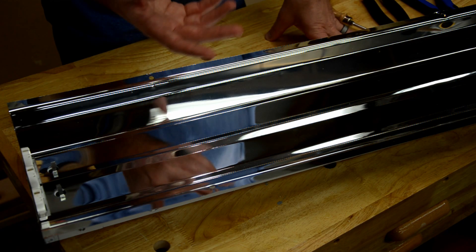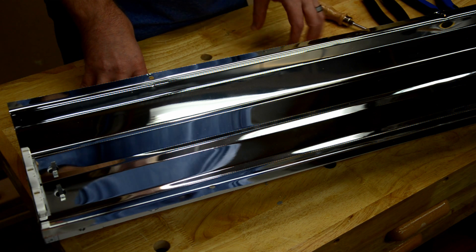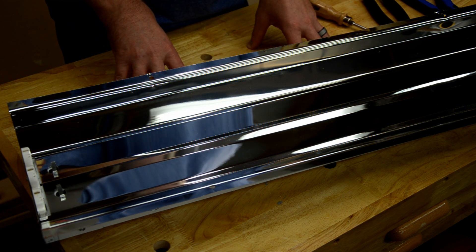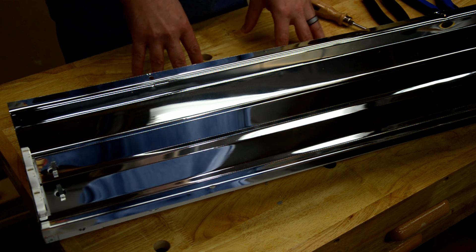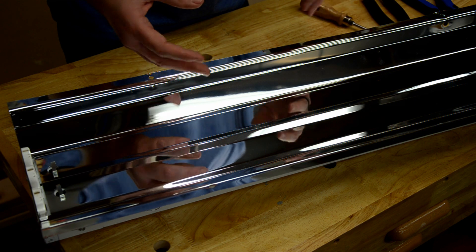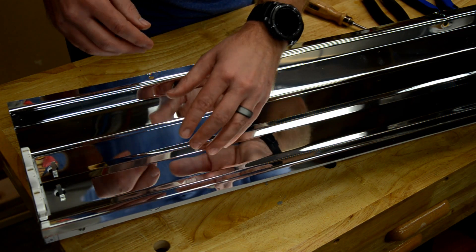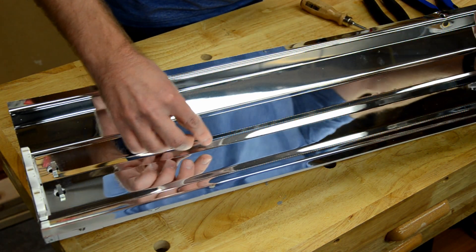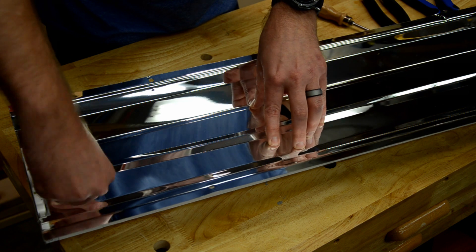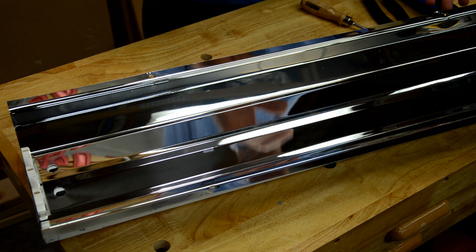I have a three-tube fixture here. I've taken it off of the ceiling — that's not necessary, I'm just doing it to make it easier to demonstrate. Obviously you'll want to take the fluorescent tubes out, and then take off the ballast cover. On this fixture the ballast cover is the reflector. If that's not the case on your fixture, you might have a two-tube fixture with a cover — sort of a pyramid in the middle with screws on each end. That might be where your ballast is. On this one we've got clips, so we just take those off on each end.